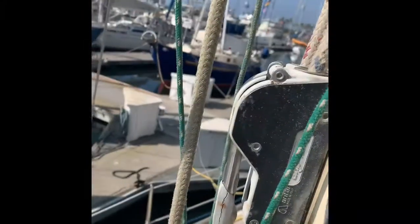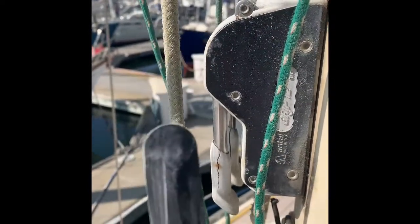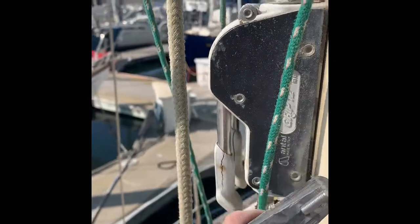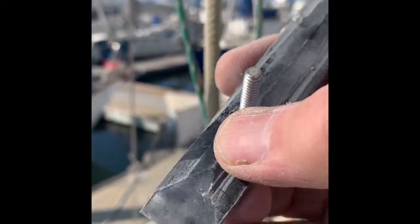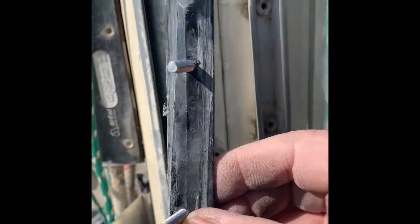So that's that project so far. Inside of the track for that sander I showed you - basically what this is, is a West Marine plastic mixing stick. It's got a rounded bevel on the top and a straight bevel on the bottom. I put that in the track and attached the sander pad to it. I wanted that bevel because the inside of the track is not entirely corrosion-free either - so it worked out perfect.